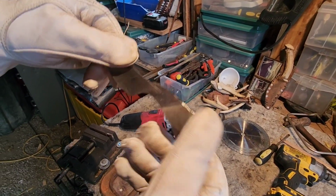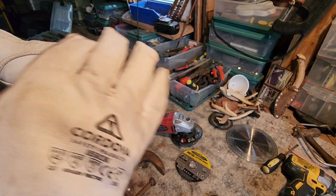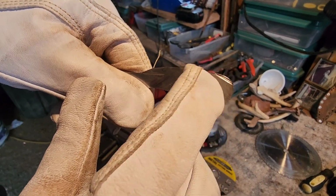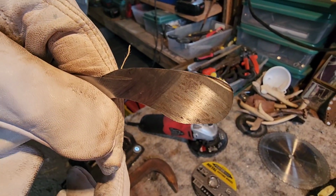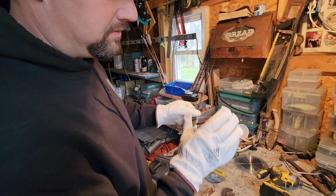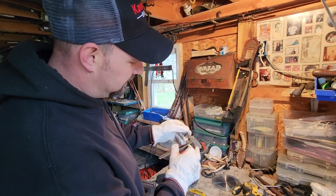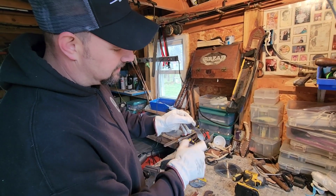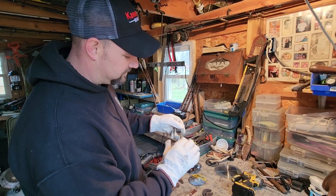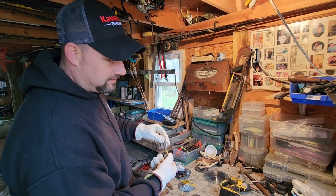Anyway, you can't mess this up, guys. Just use the hand grinder, go real slow, and make your lines. You're going to get mistakes. This is just a notch where I slipped, and this stuff's going to happen. The sanding, your steel wool and your final finish are going to be completely up to you. But this is all going to be covered, guys, so it doesn't hurt if you get notches in this. It actually helps if you're going to do an epoxy handle, to have some ridges for the glue to set in a little better.